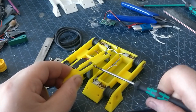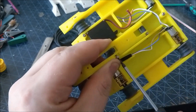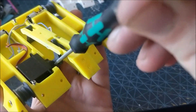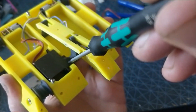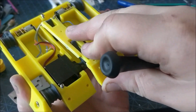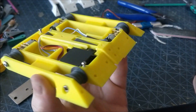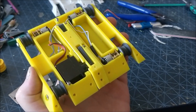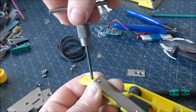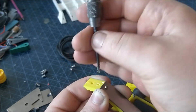The lifter arm can now be bolted together using an M2 cap head. Notice how the arm has a strange relief — it's actually so that it can clear the servo neck and sit flat. Not as strong as a solid beam, but that's why we have titanium plating. While generally considered poor form, I have always gotten away with tapping printed parts to moderate success, so I'm continuing that here.